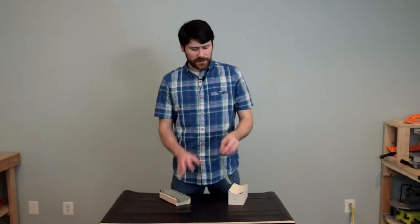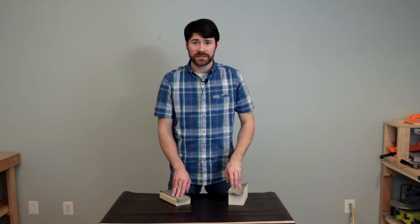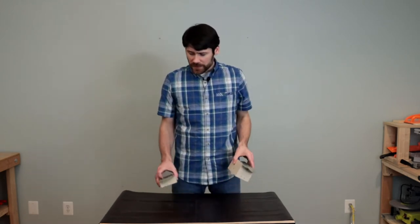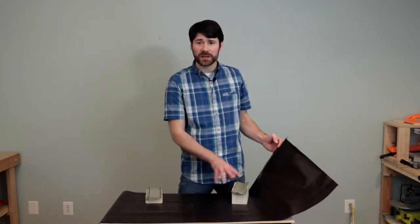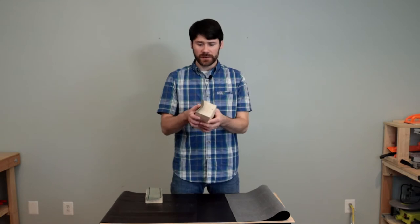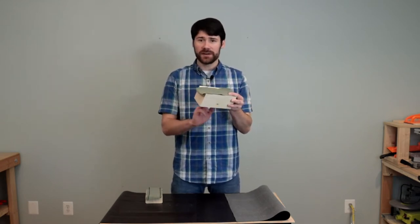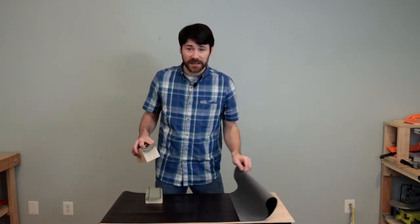I've cut some padding out of an old shirt and we're going to use that under the covering on the neck rests to provide a little more cushion for the neck. Next we need to measure out some material to cover the blocks. I want just a little extra so I can trim them flush when I fold them over. And I've got a finishing touch with some nice upholstery nails — we'll see if we can fit those around to make it look nice. Let's get these sized and cut.